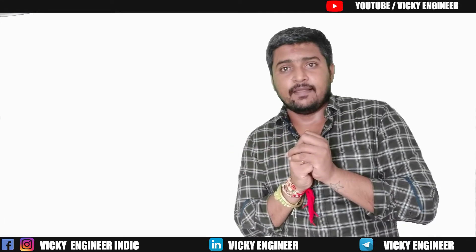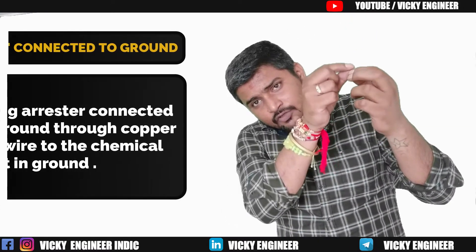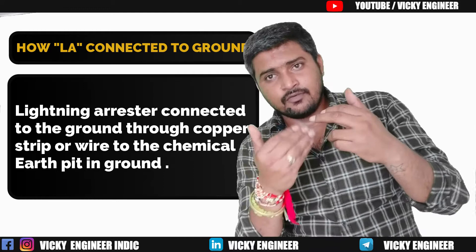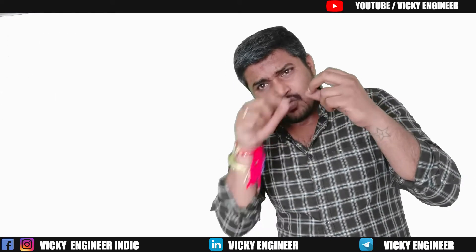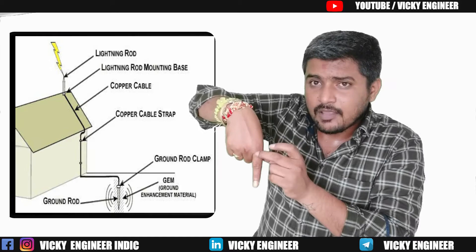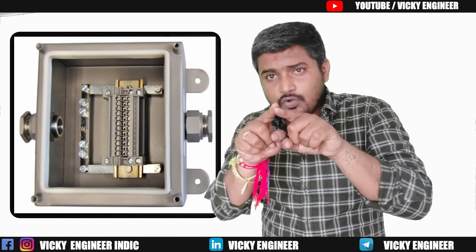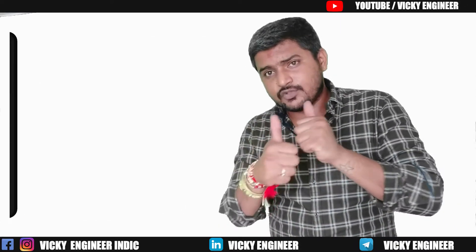The lightning arrestor is connected to the ground from the top through a wire, copper strip, or GI strip. It is always advisable to use copper for everything in a lightning arrestor — do not use GI. The connection goes from the lightning arrestor through a copper strip or wire to the chemical earthing pit in the ground. My personal advice: always use an earth terminal at the chemical earthing pit — it is affordable and provides a reliable connection.